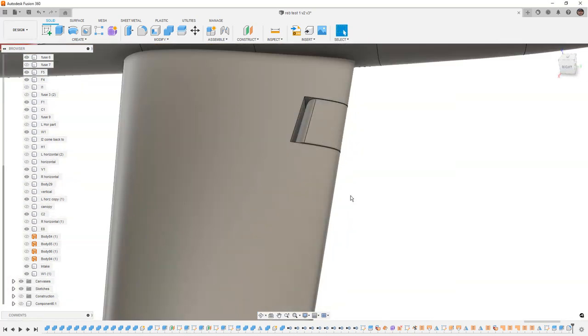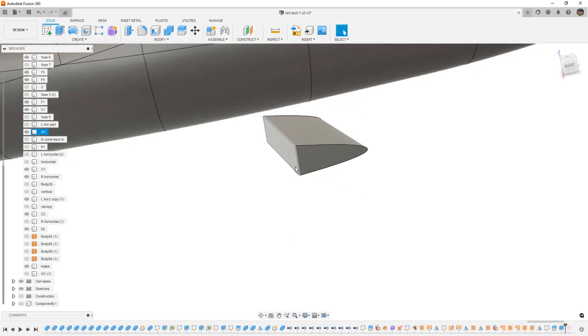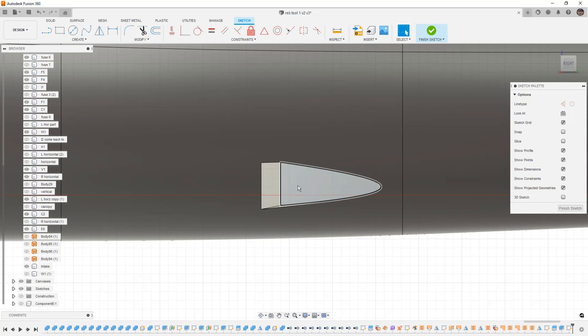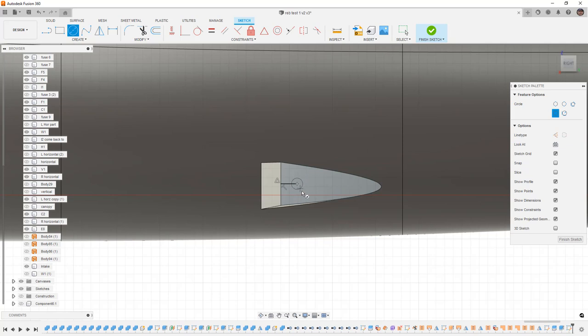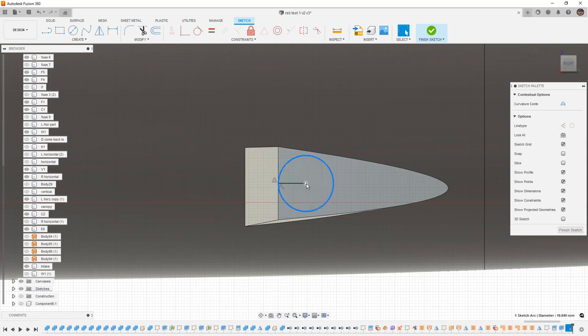That fillet might give you everything you need and is probably the shortest, quickest way. If it doesn't work, you can think about the fact that the back face and side faces are truly planar — you can sketch on them and create a sweep or cut. You have to think about where the pivot point is going to be. I'll right-click and create a sketch. Since we're dealing with something that isn't a consistent height or thickness, I'll use the line tool to find the midpoint and bring this back, then use the circle tool — C on the keyboard — to create an arbitrary pivot point that snaps to give tangency with that edge.